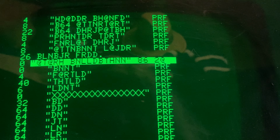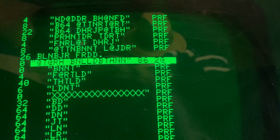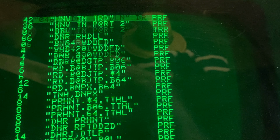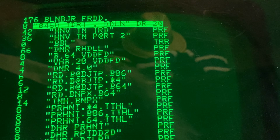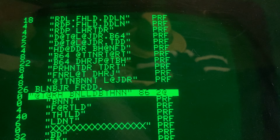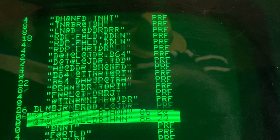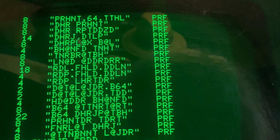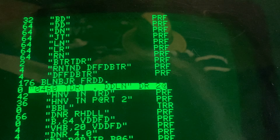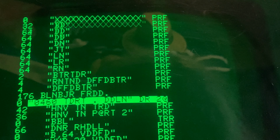I have tried everything. And that's the whole thing about troubleshooting. Isolate the problem. And I have isolated it into this computer. And after swapping out 1, 2, 3, 4, 5, 6, 7, 8 chips, including the screen RAM chips, I have come to believe it's a 6522 issue. And why did I swap out all those chips? Well, because they were socketed and I could.